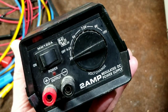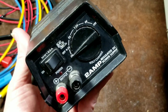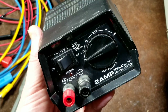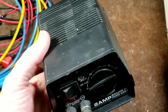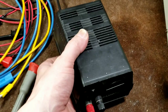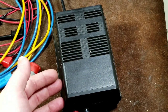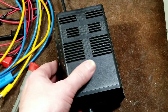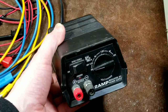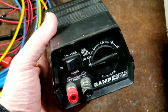And of course 12 volts. 12 volts is obviously a very common voltage for all sorts of electronics, from your internet router to automobiles. Only the newest, more high-end, really electrified automobiles are moving to higher voltage systems, but 12 volts seems to be the universal voltage. A power supply like this differs from what's inside your computer or a charging brick: it's very heavy because it has a traditional iron transformer in it. Some larger wall wart style power bricks you can feel are heavy, meaning they have a transformer in them, and they put out much cleaner power than what is known as an electronic switching power supply, which has all sorts of circuits. The big deal is a switching power supply puts out tons of electrical noise — sometimes 50 to 100 times more. It's really that much of a difference.